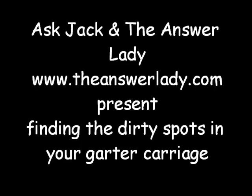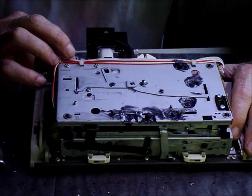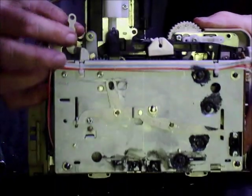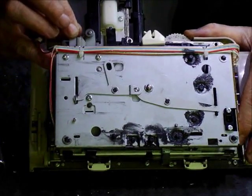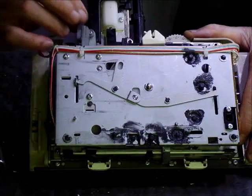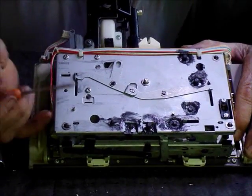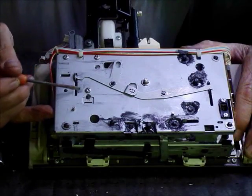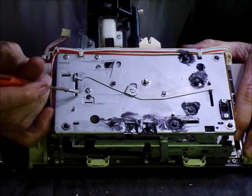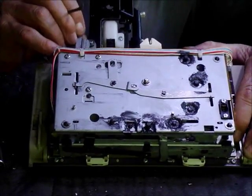The saga of the garter carriage continues with a look at where we're going to find the crud and how to get it out. This is the rod that we took loose under the circlip and lifted off the post. We want to see what it does and how stiff that movement is — very stiff. That little electronic circuit has to move this, and if it's that stiff, it's not going to. There's a footprint right here of where this goes in its lowered position. If it's not all the way back to the end of the slot, it's not going to change directions at the other end of the bed.